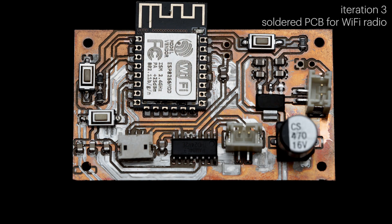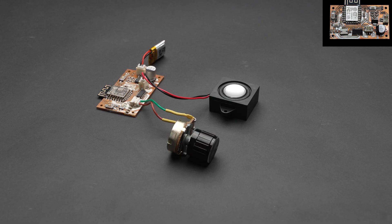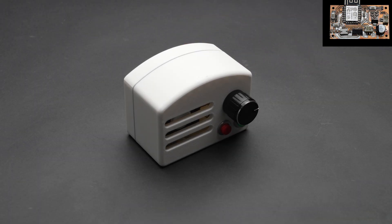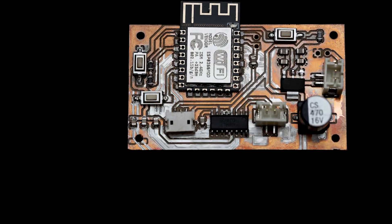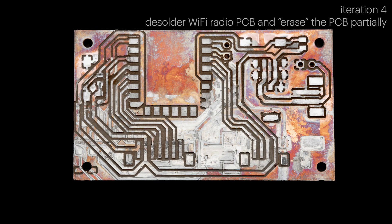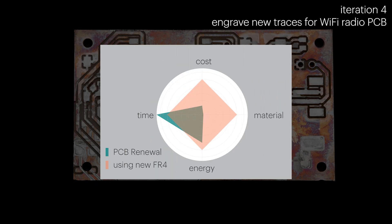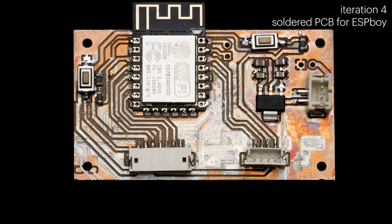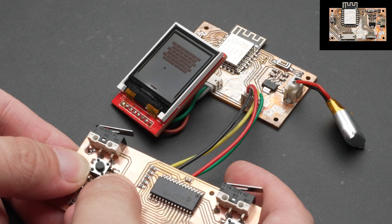This prototype demonstrates that the renewed PCB could support audible frequency data transmission while maintaining low noise levels. To demonstrate reliability of the renewal across multiple iterations, we repurposed the Wi-Fi radio circuit again as the motherboard of an ESPBOY assembly. Similar to the last iteration, this one also saved 96% of material usage compared to making a PCB from scratch. The updated motherboard effectively handled I2C data transmission to both the OLED display and the GPIO extender on the daughterboard.